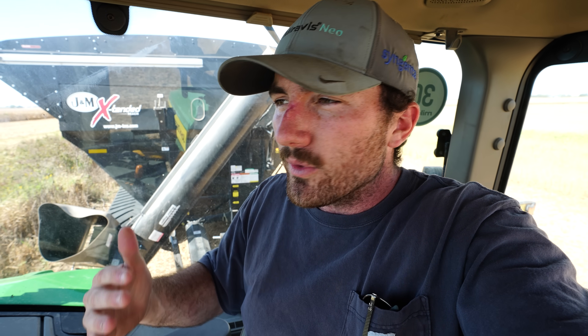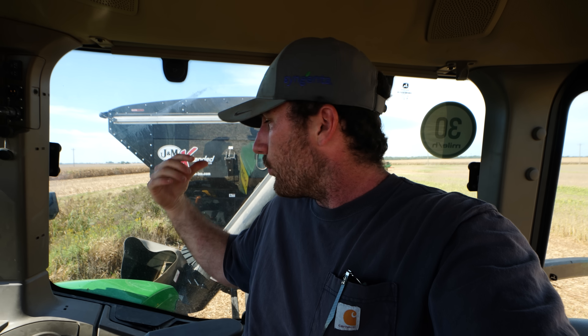A fully loaded legal semi is 80,000 pounds gross, maybe 90 depending on local weight restrictions. This grain cart full of heavy corn with the tractor is probably 110,000 to 120,000 pounds together. So yes, the grain cart and tractor weigh more — but this has 36-inch tracks. With JM's weight rating, the fully loaded 1222 grain cart has about 14 PSI contact pressure on the ground. I found an antiquated Texas A&M study that put semi tire contact pressure at around 80 PSI at 6,000 pounds of load per tire — roughly four to five times the ground compaction of a loaded grain cart.